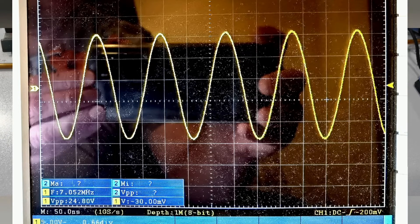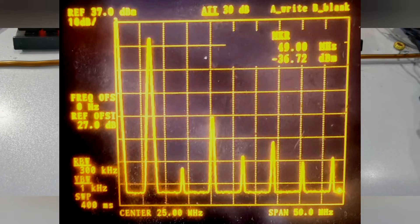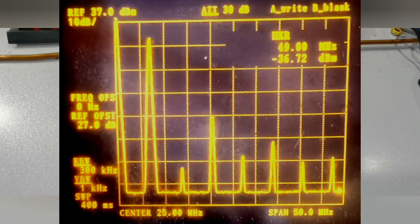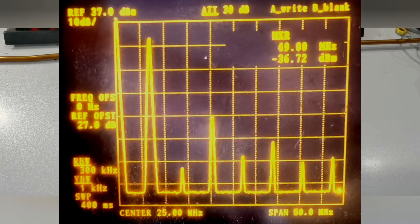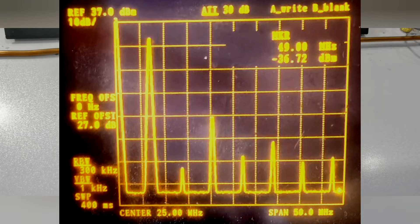On the oscilloscope it looked like a very nice sine wave. One of the advantages of push-pull circuits is a very low level of even harmonics. Here on the oscilloscope trace are the two collector voltage waveforms - quite nice class E-style pulses, with a little bit of overlap, which is expected given we're trying to do class E push-pull from just two transistors. The spectrum analyzer output confirms the low even harmonics, and even the third harmonic is about 33 or 34 decibels down on the fundamental, so it's a pretty clean oscillator even without any low-pass filtering.